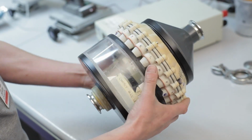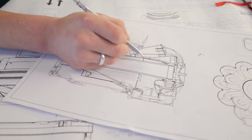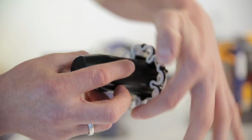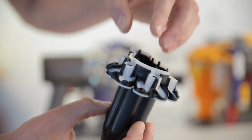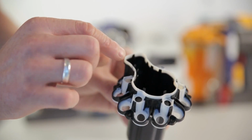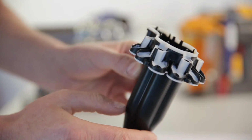And so one of the big challenges was to actually seal off all of these chambers from one another in a very small amount of space. The most obvious sealing solution for us would have been to have around each of these zones 4 separate gasket seals. Having those 4 seals in this area, there just wasn't the space to package it. We actually used an overmould where we injection mould a rubber-like plastic onto an existing plastic part, and it then means it becomes one part, which then inherently takes up a lot less space than having to fit these individual gaskets to this plastic part.